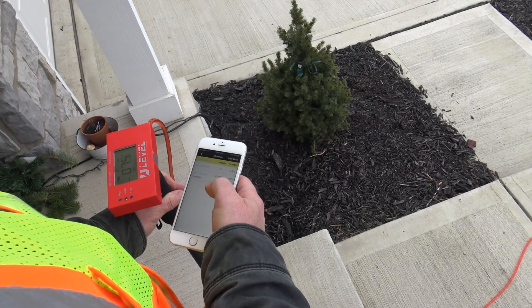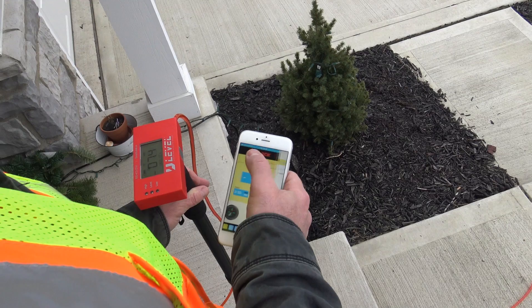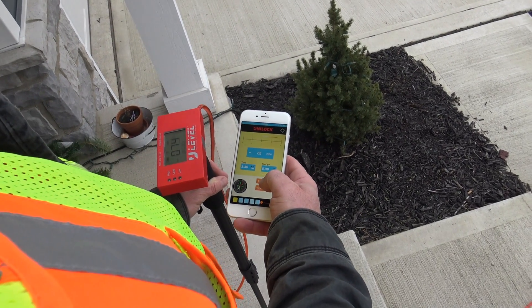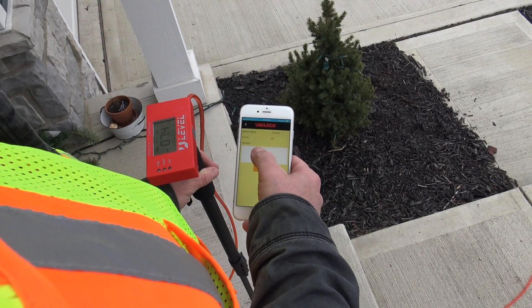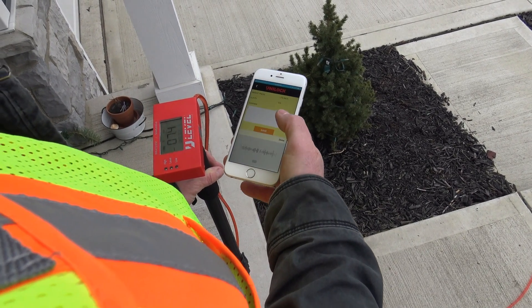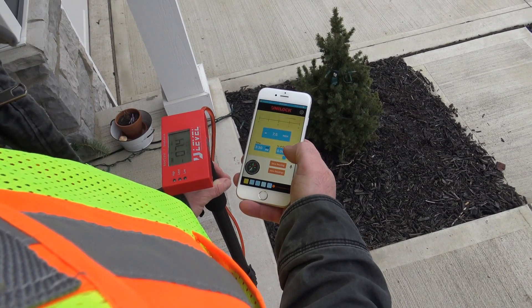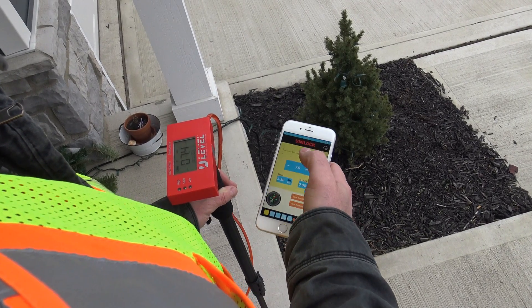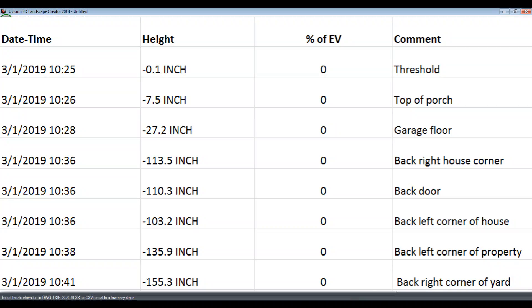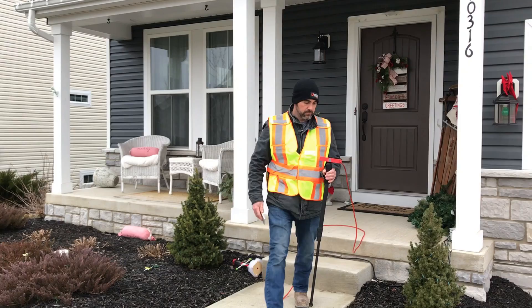Now place the U-Level on your first elevation point. Click Save Reading and it will save the elevation reading. You can save it as is or add a note by keyboard or by voice recognition. Keep it simple — like 'back door tread,' 'garage floor,' or 'street curb.' This will help keep everything organized as the data gets automatically saved into an Excel spreadsheet, which can be imported into U-Vision 3D Landscape Creator software to establish existing grades.